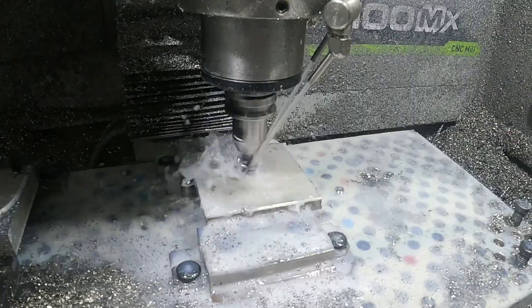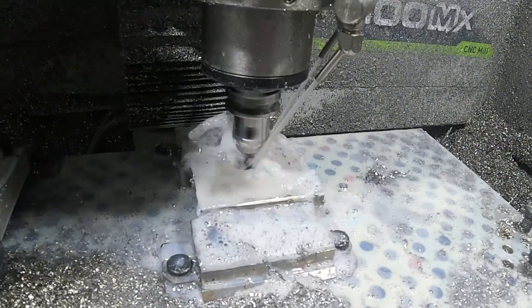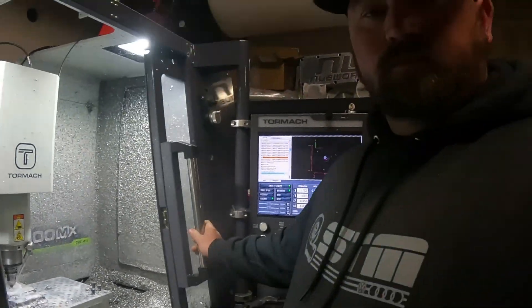It's loading up a little bit — going way light on my feed. They're telling me I can run this thing at like 39 inches a minute, which might make a better chip. Essentially I got a recipe that's working until it doesn't. This is going to allow me to walk away for a minute, take some measurements, and do programming on other parts. When this thing isn't working right and your cutters are breaking left and right, it sucks — it's giving me anxiety. So hopefully this stuff goes good. I'm trying not to push it too hard.